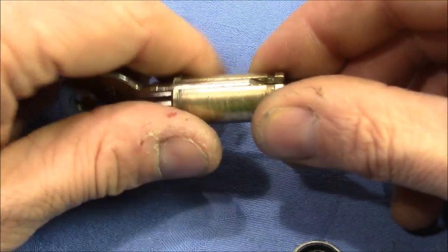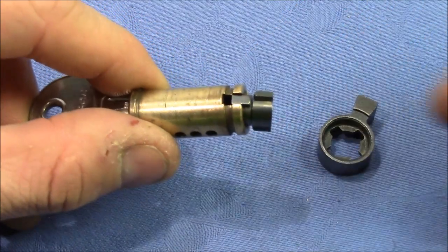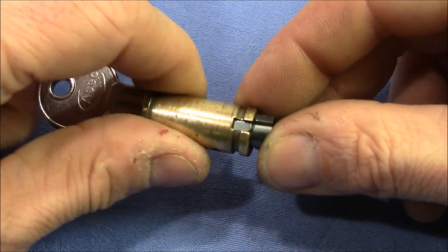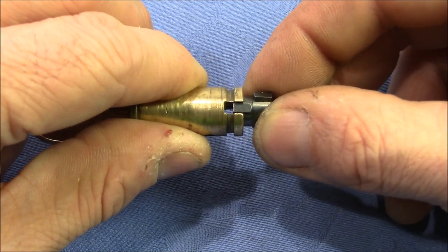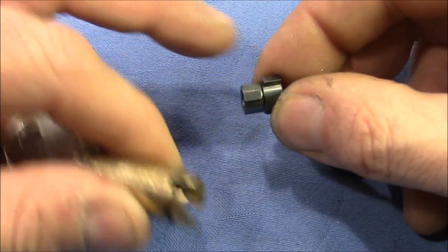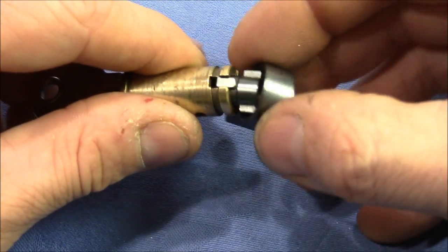But now how does it work to activate the cam? When I stick in the key, and let's assume there is no key from the other side inserted, this actuator moves out a little bit, and now only half of this nose interacts with the plug, and the other half of this left side piece can now interact with the cam with these cutouts. So let's do that.